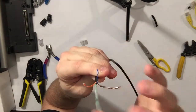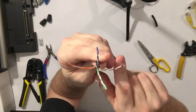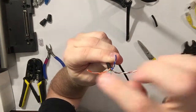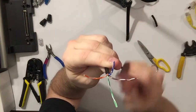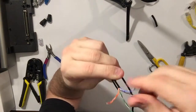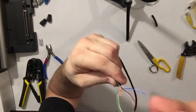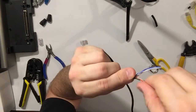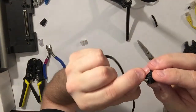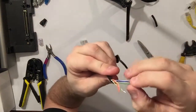Inside you've got four pairs of wires — orange, green, blue, and brown. The way I always separate mine: I move orange to this side, brown to this side, and green and blue up or down depending on where they are. So you have stripe orange and orange, stripe blue and blue, stripe green and green, stripe brown and brown. About this time I realize I didn't put that rubber boot on — I'm going to need that, because it's got to go on before you put the connector in place. I'll pull all those together and slide my rubber boot on. It'll fit right over the insulation — just pull it down out of the way.